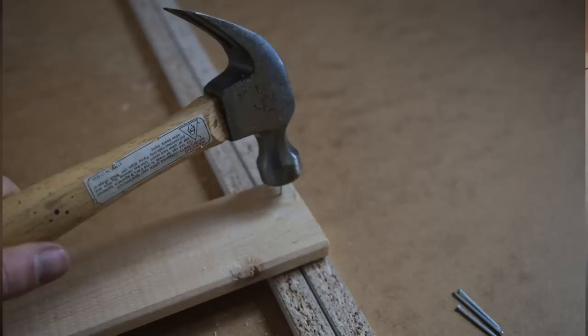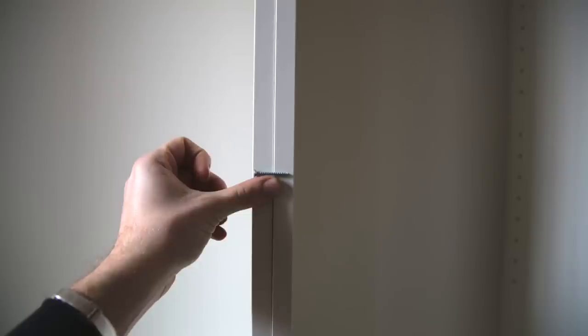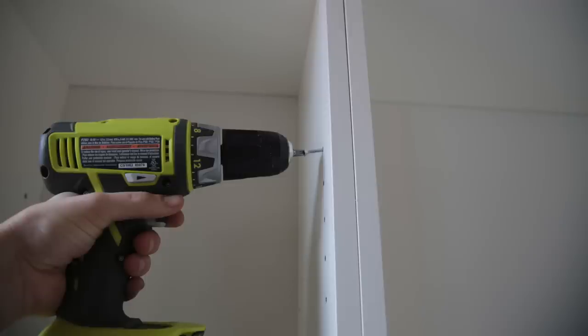The next thing I did was use some scrap wood to put the back of the bookcases together. Then I put screws in the front of the bookcases, and I actually used the holes that you'd put shelves in to join them. I just popped a little screw in there and it was perfect because it joined the front of the bookcases as well.